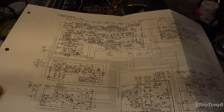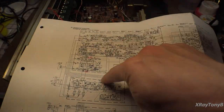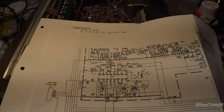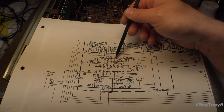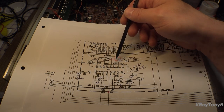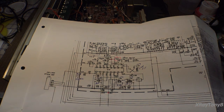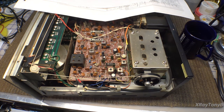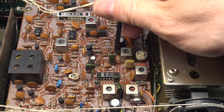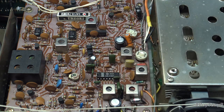Let's go to the schematics. I enlarged just this section so we could see it better. Here is the test point of R155 and here is J207 — it's hard to see because this isn't a very good copy, as a lot of old schematics are. On the actual board we can see J207 is this post right here, and R155 has its lead looped up like a test point. So we're going to inject a signal — but what the heck is this, and why are they telling us to do it this way?